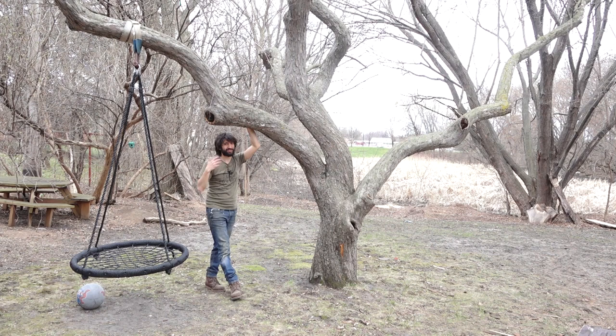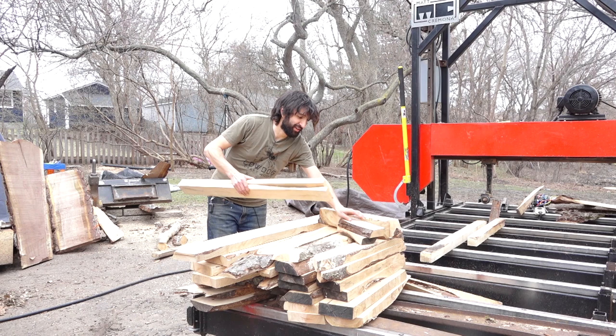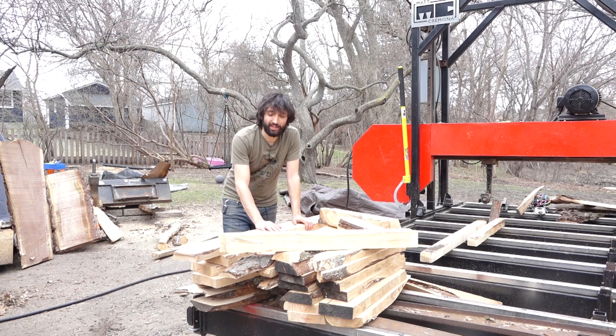Keep that in mind. If you keep a realistic expectation of what you're going to have for cutting limb wood, then it's all right. But if you expect boards that are going to stay perfectly flat and be big panels for large pieces of furniture, you're not going to get that. If you want to make smaller things — cut these up into cutting board blanks, things like that — it's not going to be as big of an issue. If you're trying to make furniture out of limb wood, it's just not going to go well for you. A lot of those logs I cut are actually limb wood. The only kind of straight grain piece is going to be that one down here with the split — that was the main trunk of the tree. The rest is all weird limbs. So I expect a lot of the stuff to distort as it's drying, but it's a sentimental wood, so it's all good.